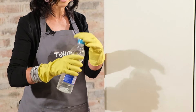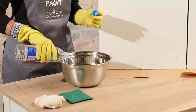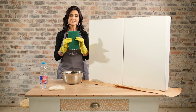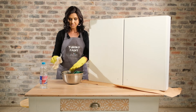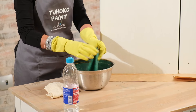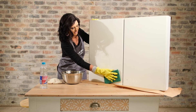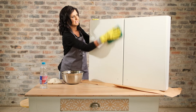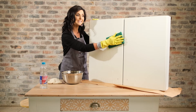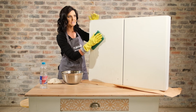I'm putting on my gloves as we are going to work with a chemical — I use lacquer thinners. I pour it in an old bucket or container. To clean my surface I'm going to use a piece of scotch pad or a rag, thoroughly submerge it in my thinners, and wash off my surface. I'll be doing this more than once to make sure the surface is completely clean. The thinners also etches the surface so that the paint can adhere to the melamine we're painting on.